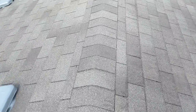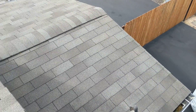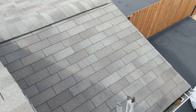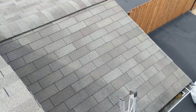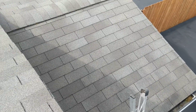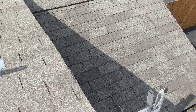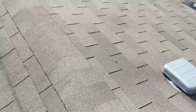At the right-hand side of the structure, more or less above the laundry room, we've identified an area of roof structure which is low-sloped. A conventional or three-tab style roof such as this is rarely intended to be installed on a roof pitch lower than 4:12 — that's a drop of 4 inches over 12 inches. This roof here has been identified to be 2:12. There are precautions you can take to allow for this sort of installation, and we're not able to determine whether those precautions were taken. Typically, you'd install an ice and water shield or a product such as bituthane to prevent that low pitch from impacting the roof structure.